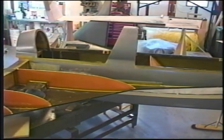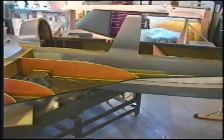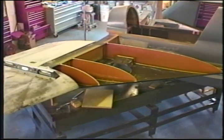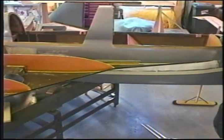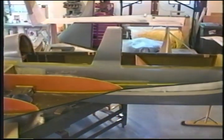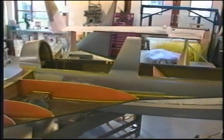We're also going to check the relative incidence positions, the leading edge of the BL23 rib. And then, of course, the inward rib is easily self-defined by its placement against the end of the wing. But that position right there, BL23, if it's right, then we need somebody to make the other side symmetrical to it. If it's not right, well, we're kind of stuck with it. We need somebody to make the other side symmetrical to it anyway. Couldn't have changed much, though.